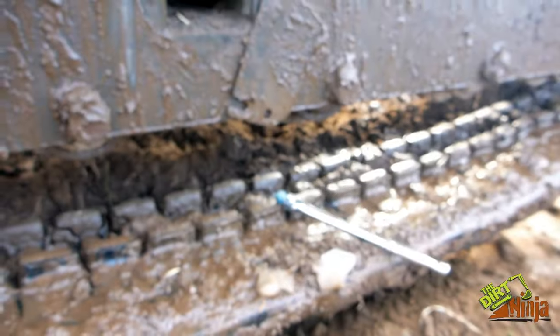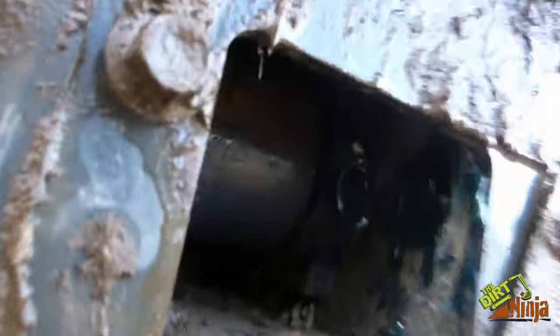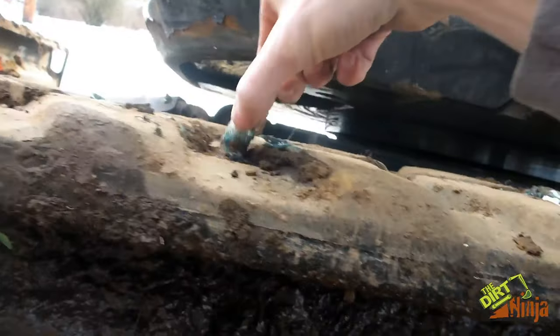See how much it's already come down. All the grease came out — just clear it away. Then you're going to want to tighten that release zerk back up so when you pump grease in later it doesn't come back out.